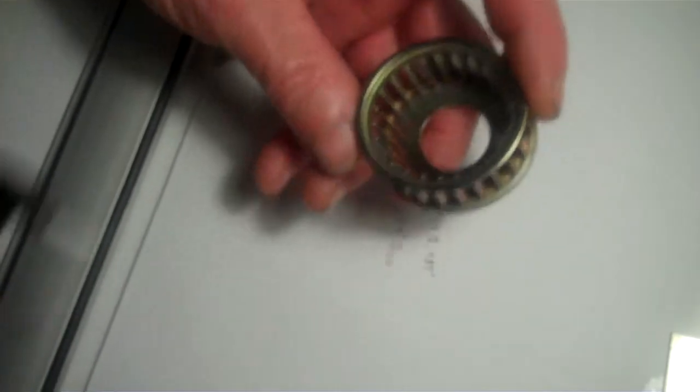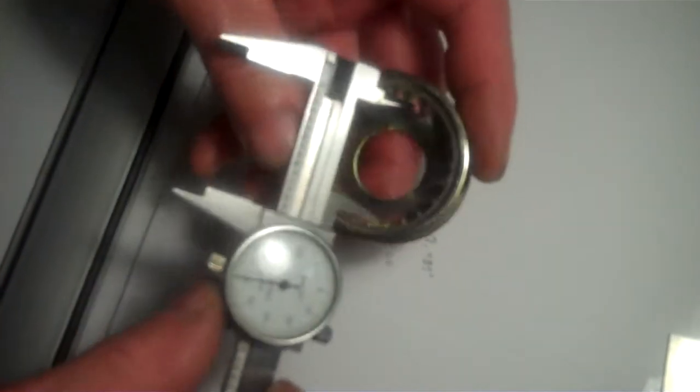And then I will initially turn the workpiece to 1 inch 450 thou, which puts it kind of tight in here, and then I can turn it down enough to be able to fit that inside here. And then after I do that, I can start working on these other dimensions over here.